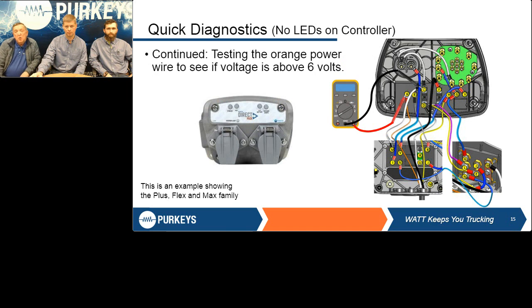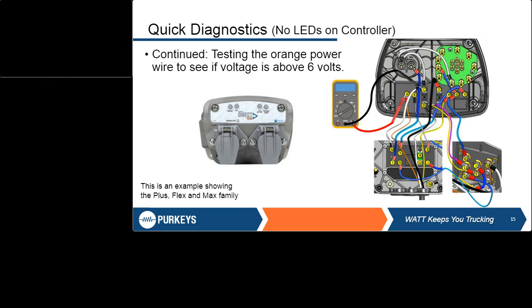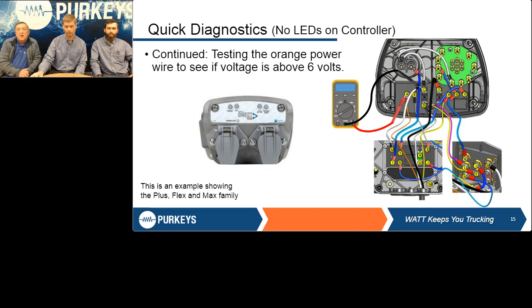Once you have all that, get the tractor started and plug in your dual-pole or seven-way. If you're not getting solid green lights and instead getting a flashing light scenario, there is a reference guide in this session. If you have a solid green light on the lift battery LED and a flashing orange on the sub source, that could mean a positive fuse blown inside the controller. Conversely, a solid green on your source and a rapid flashing light on your lift battery could mean a negative fuse blown in the controller. Check both fuses in that type of scenario.